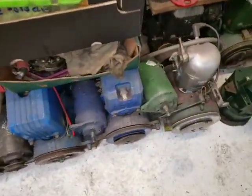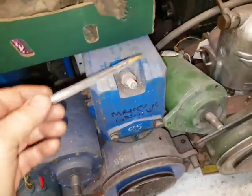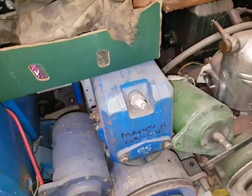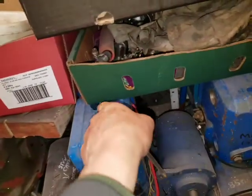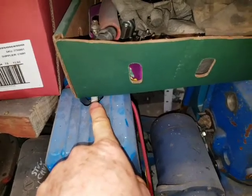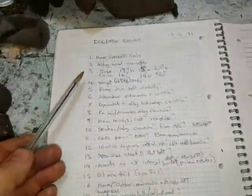With the Vire, the 7s, the spark plug is right at the front, and it's 2 inches lower, so there's no HT problem there. With the 12, it's at a 45-degree angle. It's not even higher than the engine. So more clearance for your HT there, makes it easier to change plugs.